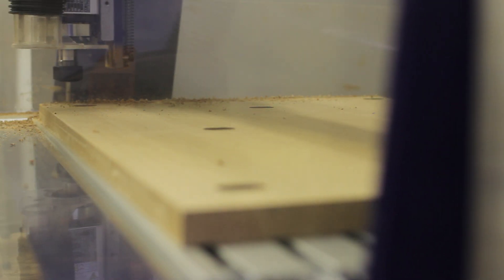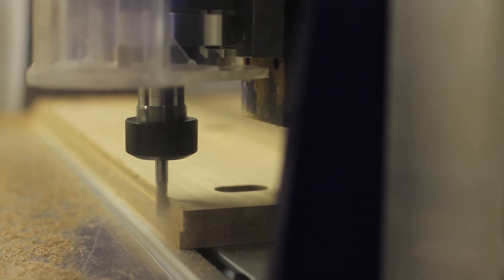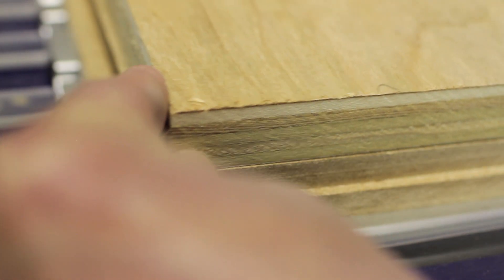There's just one more thing we're going to do to it. We're going to run one more cutting file that ShopBot has included specifically for spoil boards. What it does is cut a small rabbet all the way around the spoil board, leaving an area that's precisely 18 by 24 inches. This is helpful because it visually indicates exactly where the bit's cutting area begins — we now know where the boundary is and can place our material right up to that edge if necessary.